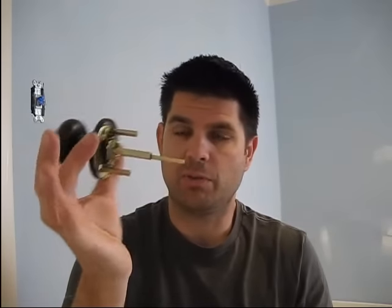It is replacing mortise door hardware with cylinder hardware. So this is the old style - it used to go into the doors and would be in a pocket in the door, just slide right in, and then this would be where your shoulder catch. The newer style, which everyone sells, which is a lot less expensive and a lot more available, are the cylinder type. I'm going to show you how to get this out and replace it with this. It goes in a couple of steps, so I'm going to walk you through it pretty straightforward so you can get an idea of whether you're going to do this or not.